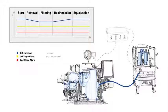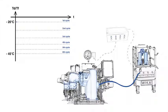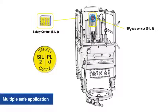After waiting for the desorption to happen, this process will be repeated until the desired target humidity in the GIS gas compartment is reached — compared to a standard gas exchange with an SF6 handling unit. This way, not only the SF6 is dehydrated, but also the gas compartment itself.